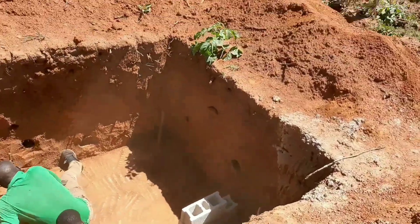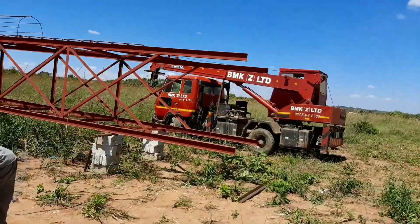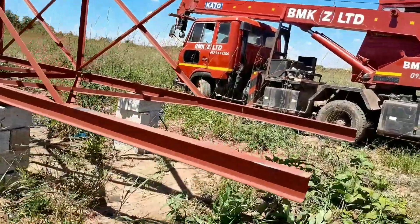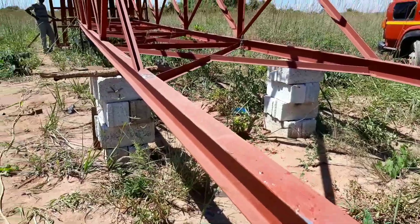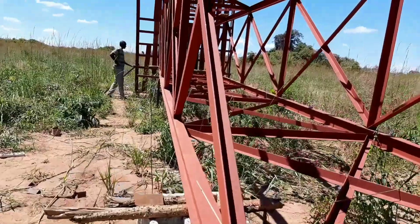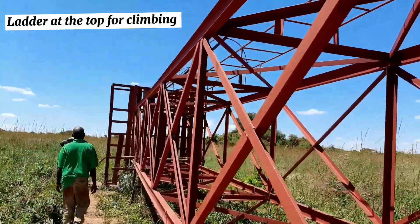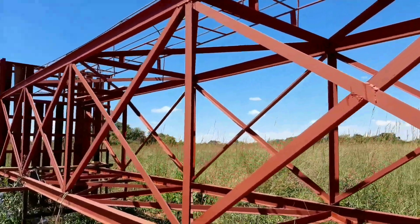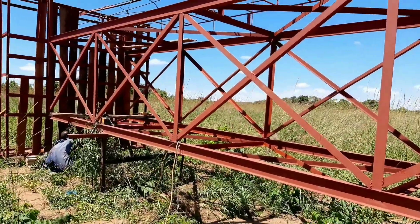The base of this trench has about 30 centimeters thickness of concrete with a mesh of Y-16s. These two channels are meant to rest in that trench — the thickness is similar to the ones used in the rail industry as sleepers. Given the height of 10 meters, we had to make sure they were quite strong, and unfortunately they were quite expensive. You can also see a ladder at the top there to climb up to the top of the tank stand.